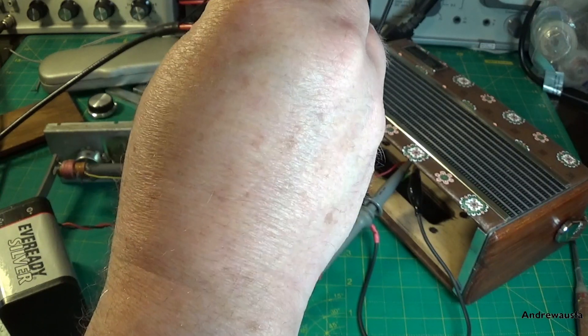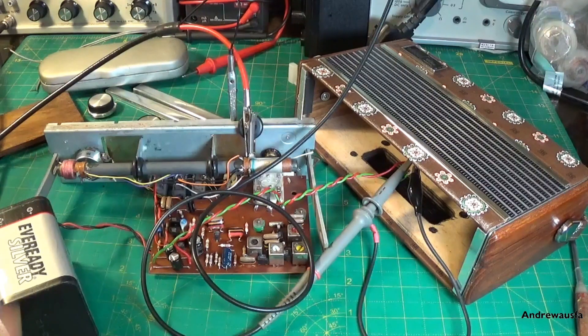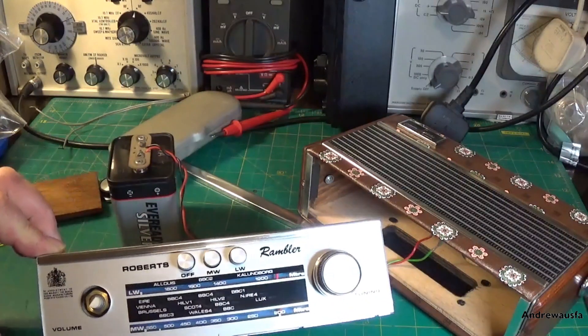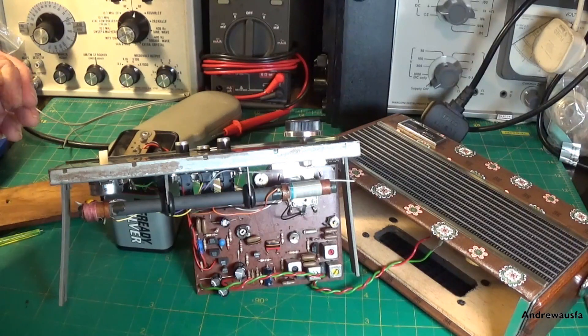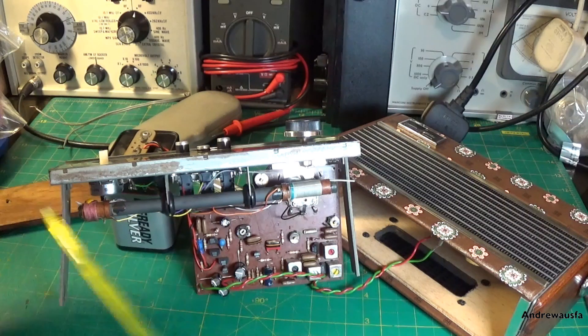You can hear it fade. There we go — that's the IF aligned at 470. Next I'll just run through the dial pointer alignment, but I would say that's pretty much spot on anyway. The next thing we need to do is set the pointer to 200m on medium wave, set the signal generator to 1500kHz, and then we need to adjust VC2 and VC4 so we hear the signal generator output through the speaker. I've got a screened radiating loop at the end of the bench — the one I built to Hacker's design, which the video is on my channel. Let's have a go at this and see where we get to.